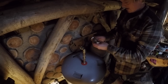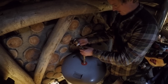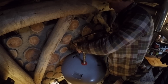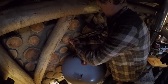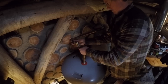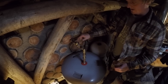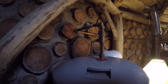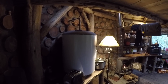Let's get this screwed on — make sure it's the right way. We want water to flow through there into the tank, we don't want it to flow out of the tank. Slide that one in there, get this tightened up, then we'll bleed the air out of it. That should stop us wasting all our hot water. The connection's fitted.